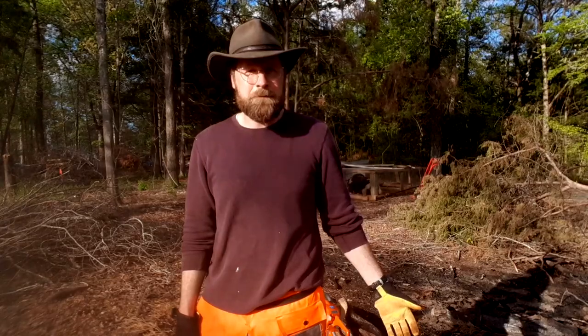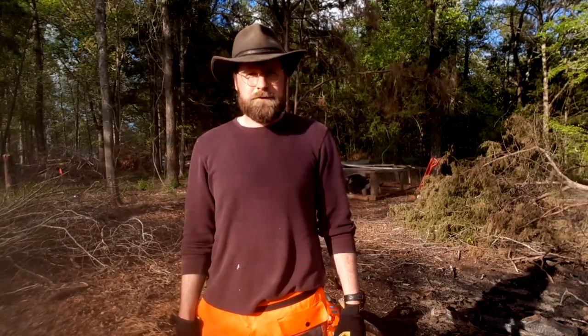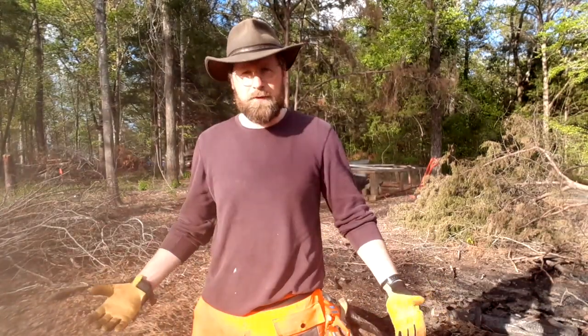So this is a pretty simple thing to do. If you're familiar with how to operate a chainsaw, this will be no problem. All you'll need are a power drill, a 12-foot 2x4, a couple of two-and-a-half to three-inch screws, a chainsaw, the mill attachment, and of course your cedar logs. Let me put that together and show you how it works.